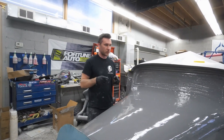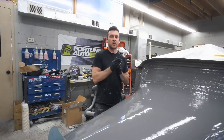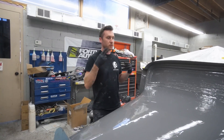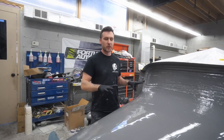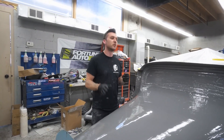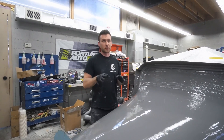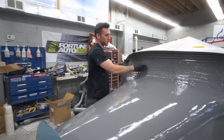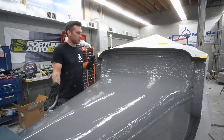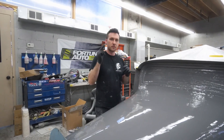We're going to go ahead and cut some 3k carbon, then do the 3000 series high temp epoxy and back it with a layer of 3k, and then back it with two more layers of 12k. If we take it off and the mold seems a little too flexible, I might add another 12k layer to make it four layers total. We start with 3k because it gets into all the creases a little better than 12k will. Since we're not vacuum bagging this mold, we're going to hand lay it up — 3k, then two layers of 12k.